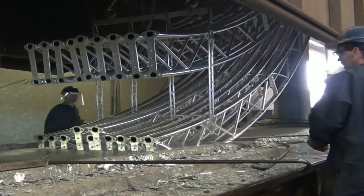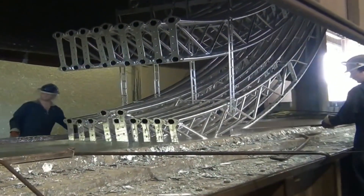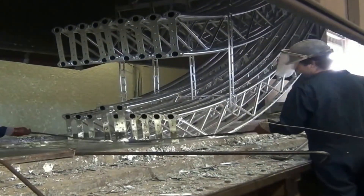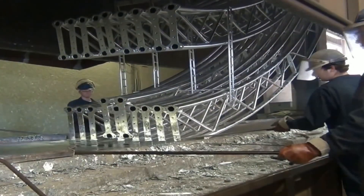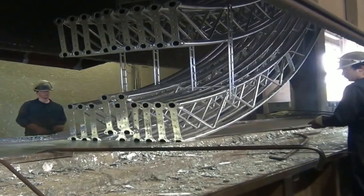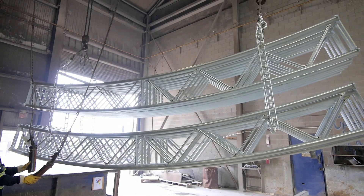When trusses are fabricated and welded after galvanizing — also known as pre-galvanized — the fabrication process will burn off the zinc coating on the inside of the tubes when the web is welded to the tubing. These sections never get re-protected and the tubing will rust from the inside out. This quality standard is applied to all of BrightSpan's steel trusses.